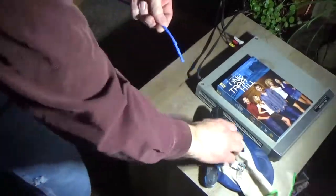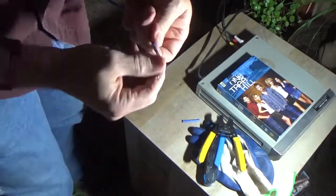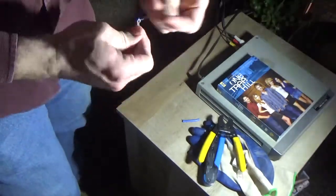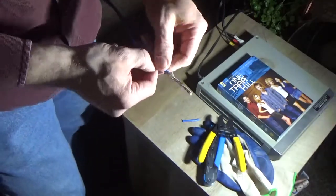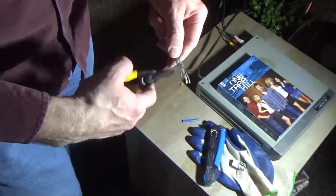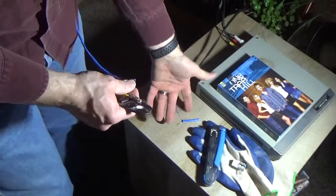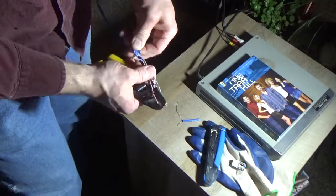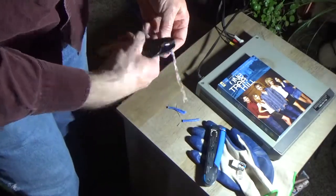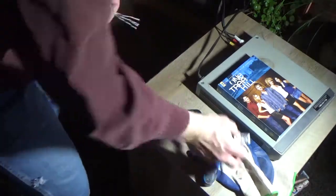It's voiceover time - there was a lot of noise in this segment so I'm going to voice over here. What you will see on the Cat5e - and actually most Cat Ethernet - is there is a little string inside that you can use to rip the plastic away. What I did was quickly cut away some of the plastic so I could pull that off the end, and then I'm using that pull string to rip the plastic back. That prevents any tool nicking from occurring on those wires because you're only using the string to rip the plastic.